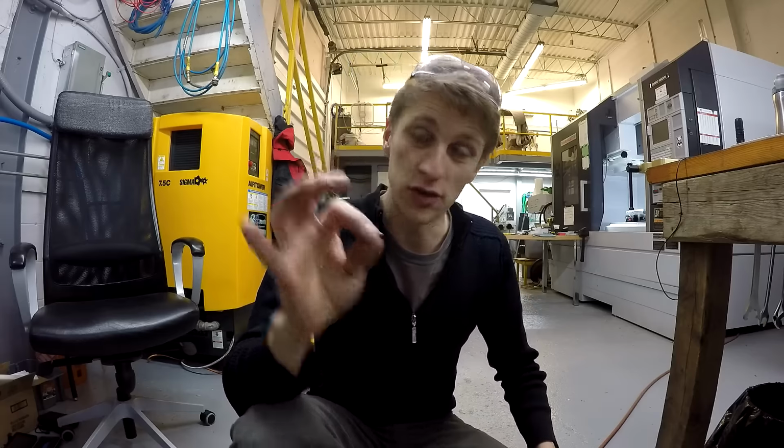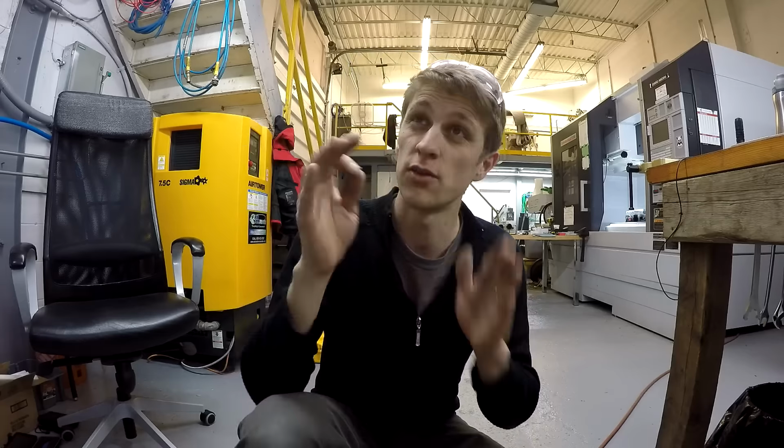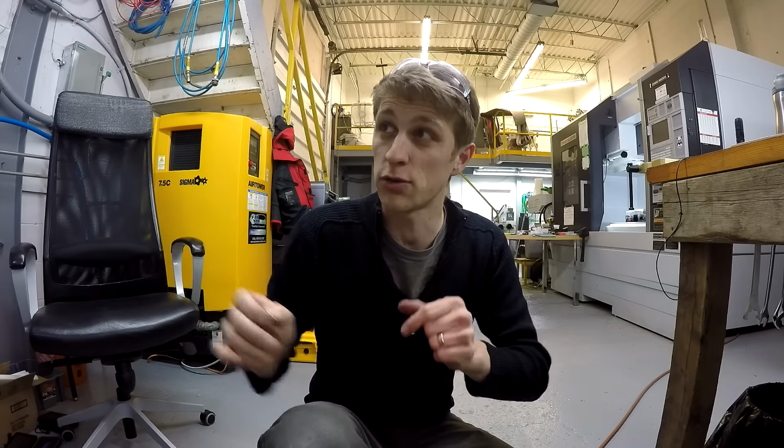So now I have the screws good. I have the bar puller pulling good. A bar like that does about 56 screws. I should be able to run it. We'll see what kind of tolerance I can hold over a bigger run.